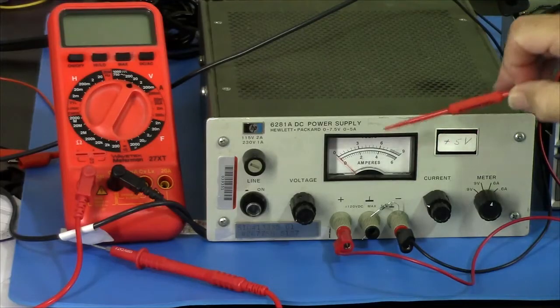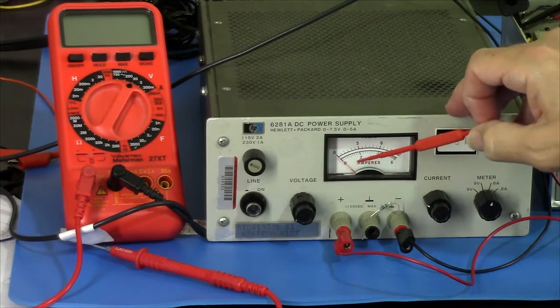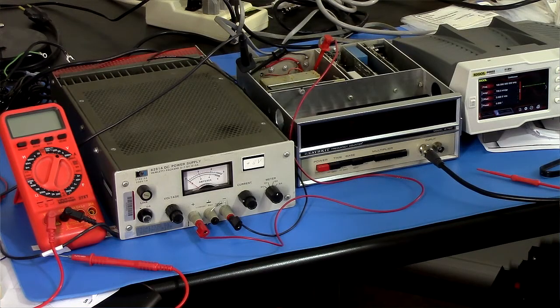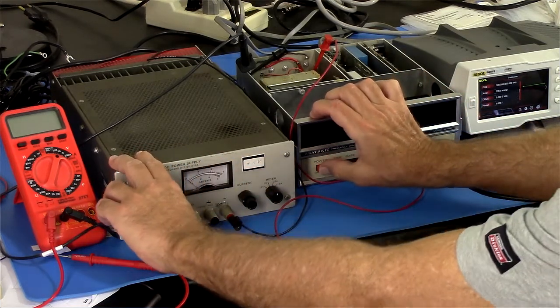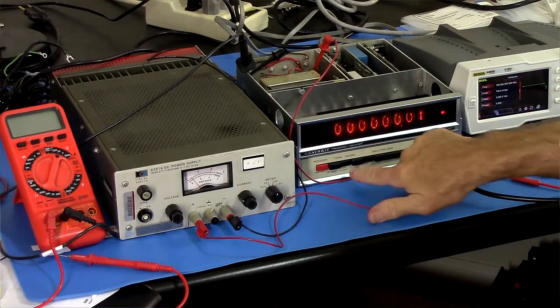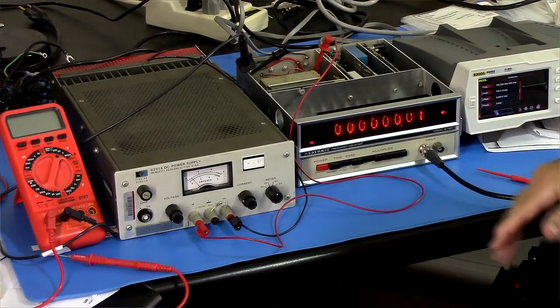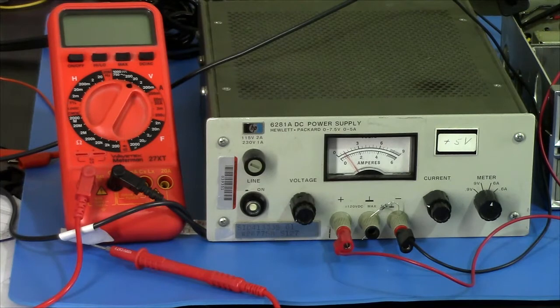You can see on this meter over here, this is set to measure the current. That's 6 amps full scale, so 1 amp would be down there somewhere. So if I power this on, I'll do these together. Okay, and there we are. I'm on 100 millisecond time base and times 1, so we have not switched in the multiplier yet, and that is drawing, well, from here it looks like about 600 milliamps, which isn't too bad.